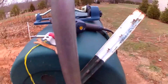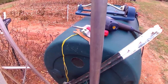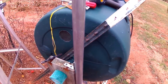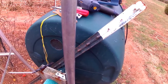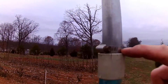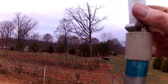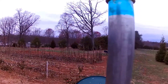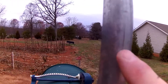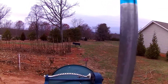One day when the weather warms up — it's kind of chilly today — I intend to spray this pole with some clear Krylon spray to protect the aluminum so it doesn't oxidize. I also used a heater hose-type clamp around the pole so it wouldn't drop down into the larger diameter pole. I'll probably drill a small hole and add a small sheet metal screw to prevent the top section from rotating.